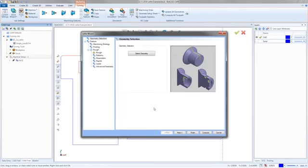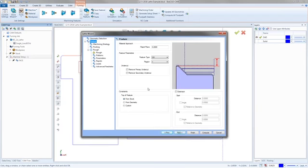So now that we got the geometry selected, we just next our way through. Now, I cannot emphasize how important this page right here is. It controls so many things that it doesn't seem like it's doing much, but when you start doing ID work and you start doing back facing and front face, all these different things, face grooves and stuff, you can't just leave it on OD. The OD setting here is really telling BobCAD what orientation the tool is going to be in as we cut. If I switch it to ID, well, now the tooling page just changed. It's going to have a different feature. It's going to have a different orientation on its tool as well. So you do want to make sure you set up this feature type properly.